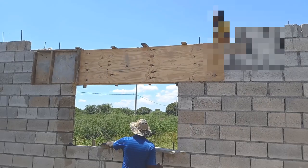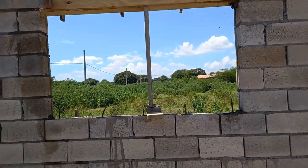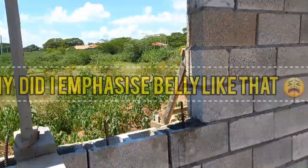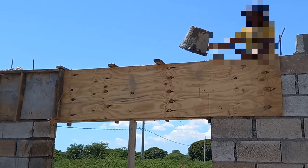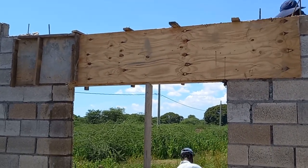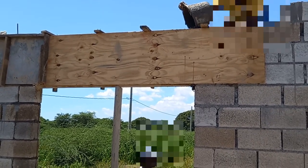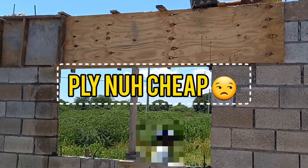As you can see here, this is the mason casting the lintel. You see this board beneath the lintel being used by the builder to help prevent a belly from forming beneath it. That's because concrete — sand and gravel — is heavy. You can see the builder pouring that mixture in right there. In order to avoid any deformity in the lintel, that piece of wood is used throughout the building process.